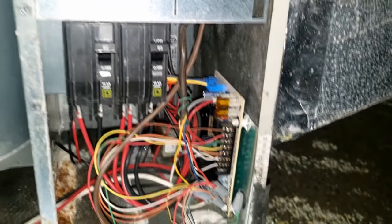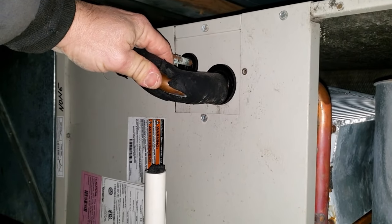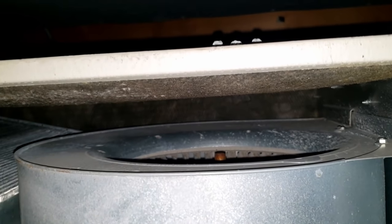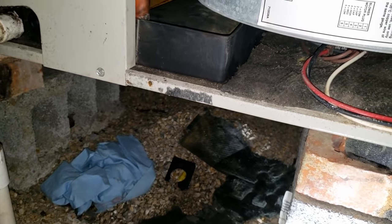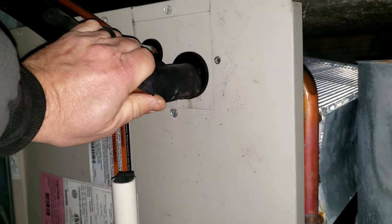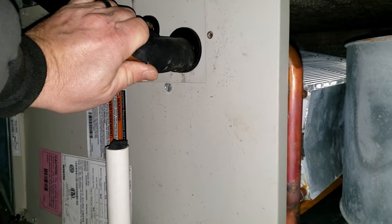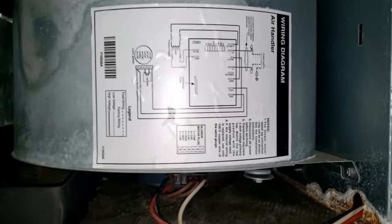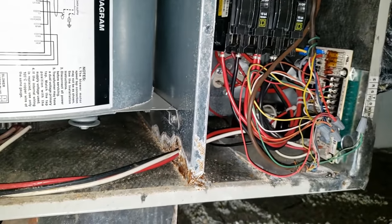There goes the heat pump. I haven't even checked yet — is it putting out cold or hot? It came on immediately and the fan's not running because of a delay. I wonder if we've got a contactor sticking. It's starting to warm up, so at least it's running in the right direction — we know we've got the reversing valve working. Nice of the fan to finally come on.